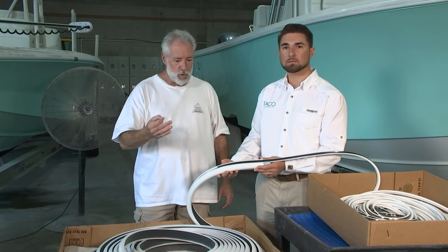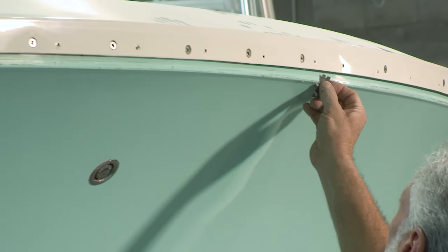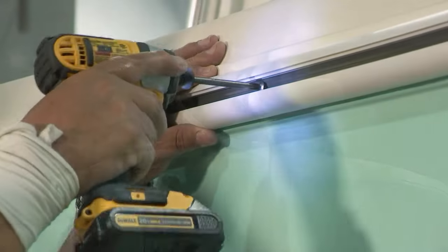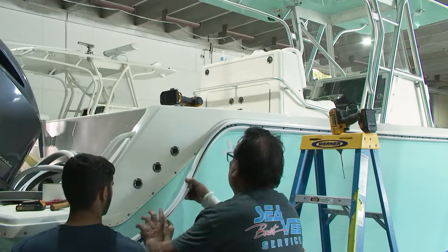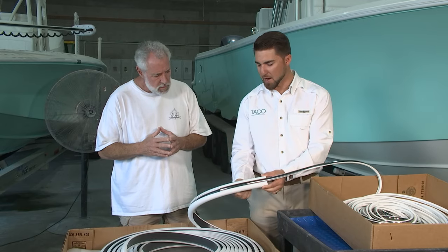Let's take everybody through what Alfredo is going to do to install this. We have a lot of existing holes from the original rub rail — how do you go about sealing those? Get a bead of 5200 and seal over those existing holes, then apply your new rubber on top of that. About every six inches is how you space your screws, and your holes are not going to line up — that's why you want to make it watertight with the 5200. Once installed, you seal the rub rail with traditional clear or white marine sealant — a bead over the top and on the bottom — so water doesn't get behind it and push the rubber out.